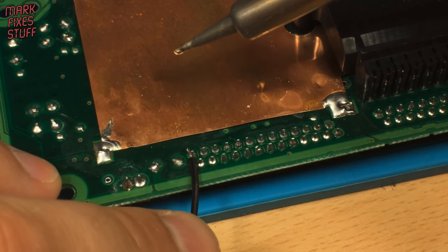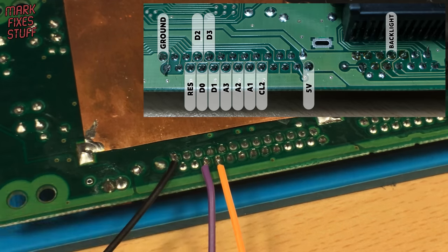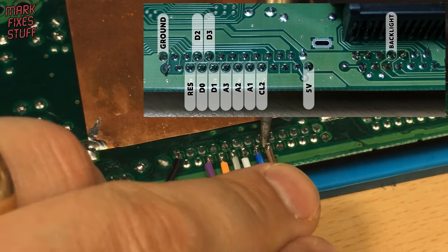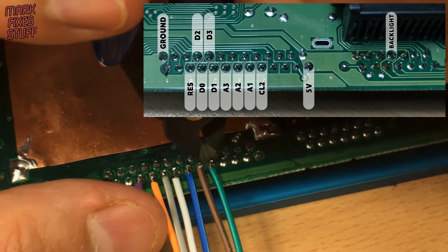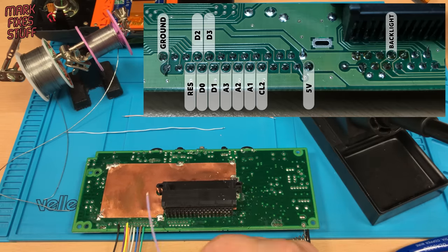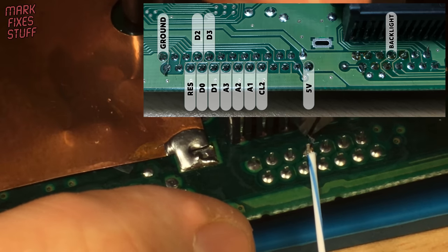It's time to start attaching the wires. It can be difficult to see which point is which, so I created a graphic with clear labelling. I've used different coloured wires for the sake of clarity in this video. The preparation of tinning the wires and fluxing and pre-loading the solder joints pays off here — the wires fix easily, making solid joints. If any of the wires are protruding from the joints, I simply cut them back with a sharp pair of flush side cutters, making sure any cut ends are removed from the board.